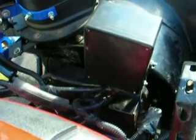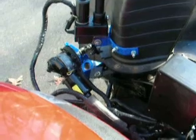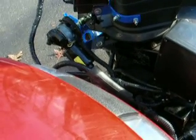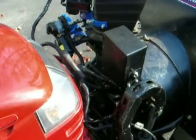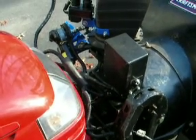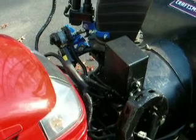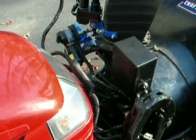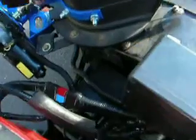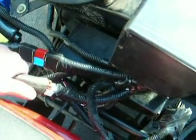It got pretty complicated in terms of the wiring — went way overboard. I've actually had this implemented in one way or another for a couple of years. I just wanted to clean it up, make it neat, and add the angle which I didn't have until now. Originally I used wires directly from the switches to the linear actuators, but there was a lot of loss in current and power, so the actuators would move quite slow and the switches got dirty over the years. I made this more robust by having actual relays inside this box right here, located right at the snow blower. Power comes to the snow blower through this mega connector, and controls come through here to actually control the relays.